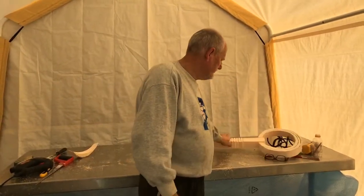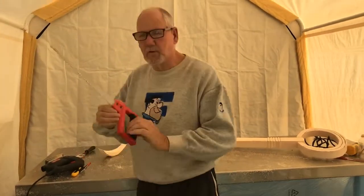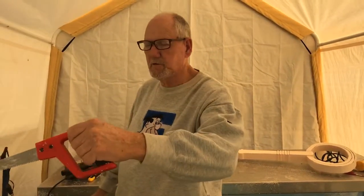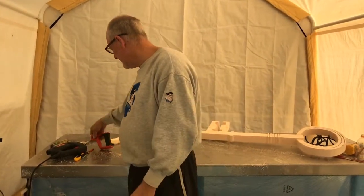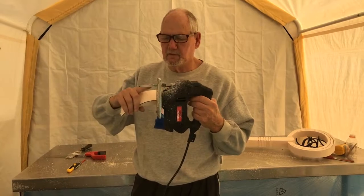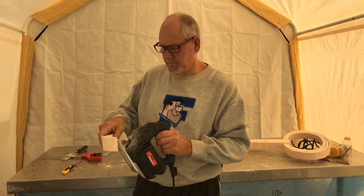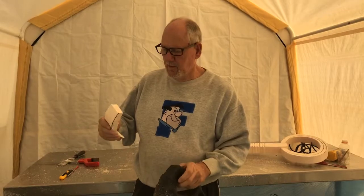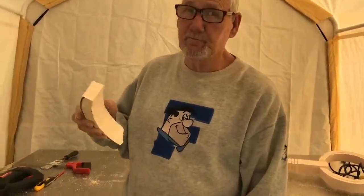If you're cutting and you just want to rough something in, these little saws like this are fabulous because you can cut straight into the material and it'll reach deep on a piece of material. But if you're just doing something lightly, just get a little jigsaw, put a blade in it that has very few teeth, and you can just cut through this thing so easily. The smaller the teeth, the better the edge — and that'll save you some sanding.